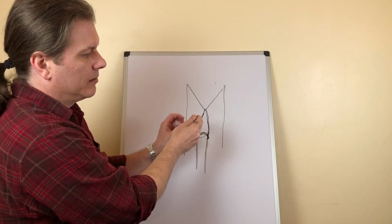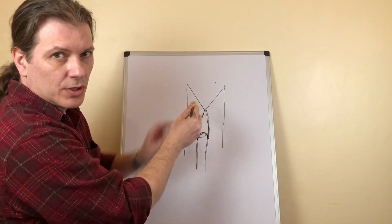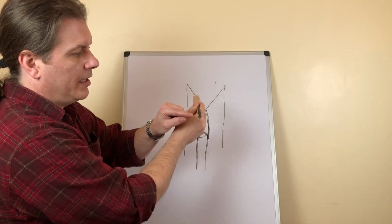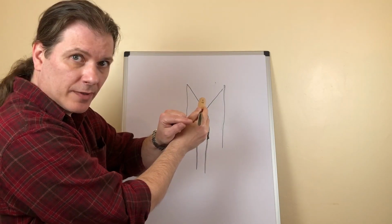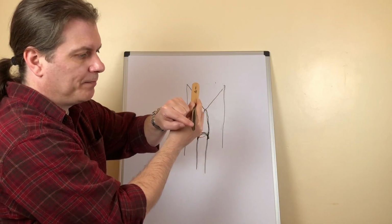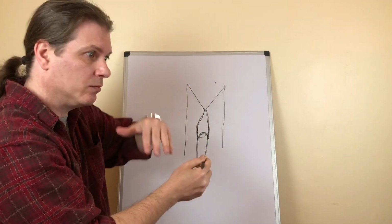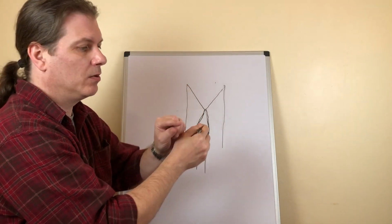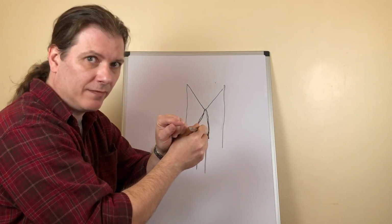Now these wings, they're in a different orientation, but you don't want to use a tool like this into the surface of wood below the tips of those wings, because then you will no longer be cutting. The top portion here be more likely to pry and break wood out. So try to always keep your wing tips above the surface of the wood.